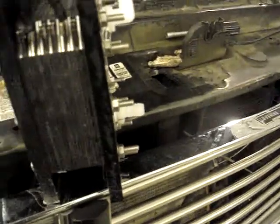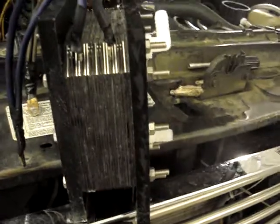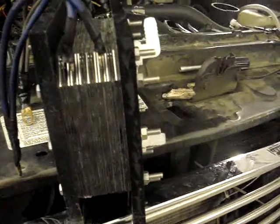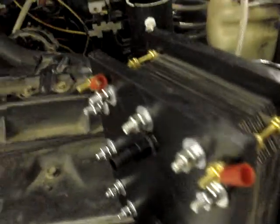There are a bunch of different methods — you can count threads on each bolt, use an inch-pound torque meter, there are a lot of ways to do it. I run them just about an eighth turn past finger tight, then run the cell, heat it up, purposely run it at about 100 amps, let it get nice and hot, let everything relax, let it cool down, check for leaks. If no leaks happen, I jam nut it. I don't use nylock nuts because your torques are too inconsistent. The jam nut method is sufficient — you can see the two nuts on each bolt on this cell.